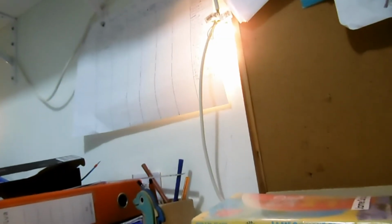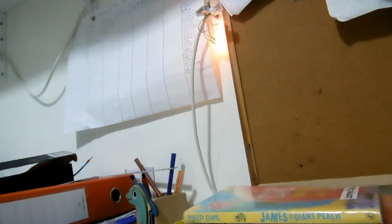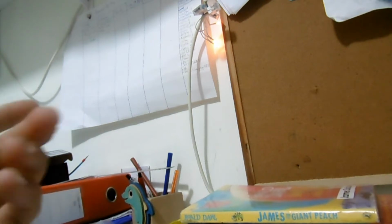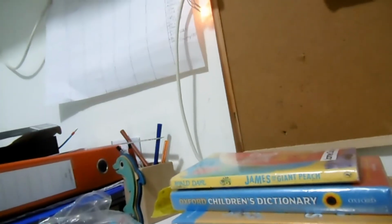But there's a catch. Look at the bulbs. At 12 volts, they're all good, lovely. At 9 volts, 7.5 volts, 6 volts, 4.5 volts, oops, 3 volts, and that's our disadvantage. Once the voltage across the fan drops, the voltage across the bulb drops because they're connected in parallel. So we need some kind of boost buck converter regulator, which I don't have. So I'll have to stick to this junky setup for the time being.